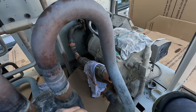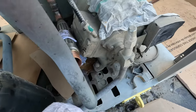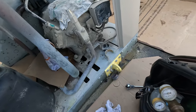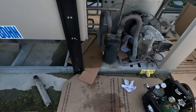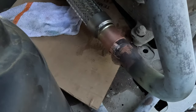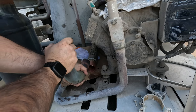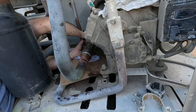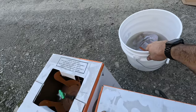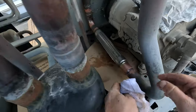Let's see what we can do here. Obviously I'm not running nitrogen through this thing here - even though I could, actually I can't because you've got to understand: if I contaminate the 168 pounds of refrigerant - which obviously isn't all full because we have a leak - then I am going to be up a creek. We'll get the little grinder out, grind off some of the slag from the outside. That shows you what we're dealing with - a hell of a lot better than what it was before. Then we get this baby running, squirt it some oil, squirt it some refrigerant, and roll out.